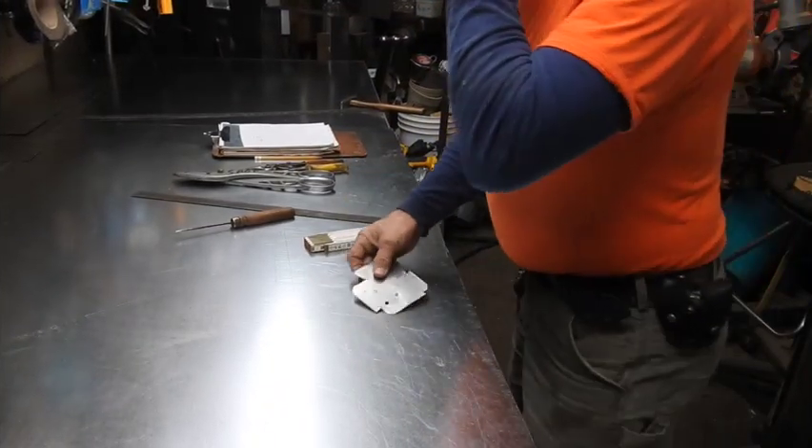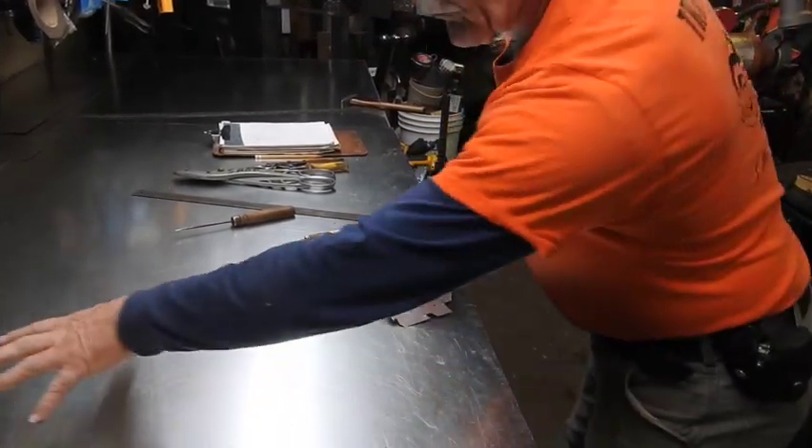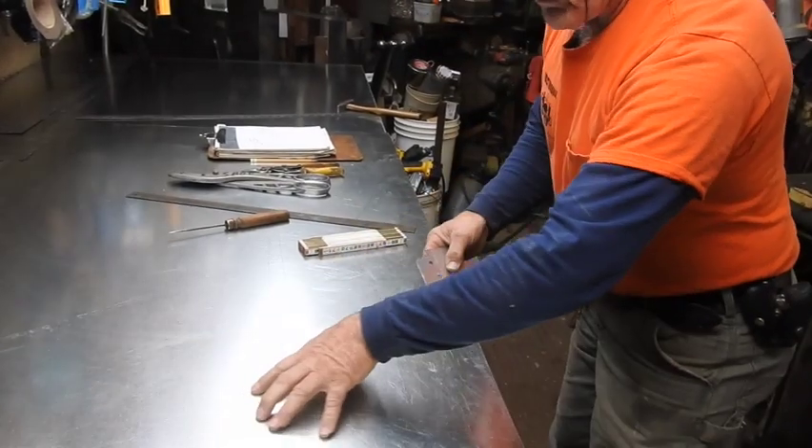Or you can go with the type I typically make: you go out square, 45 off, and then correct it so you have a semblance of a radius with those two bends. That's what we're going to do today. Looks like this is going to be 10 by 20, so the first thing we can do — we know the radius is going to go like this right here.